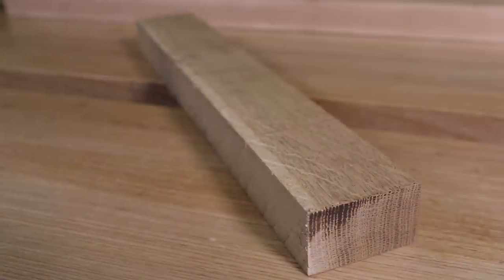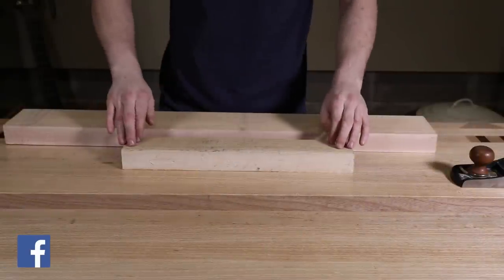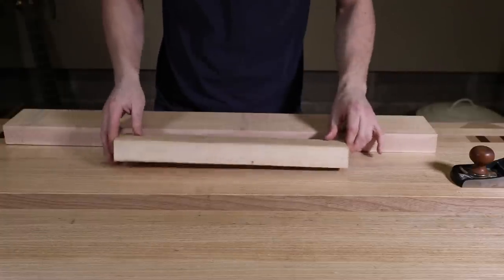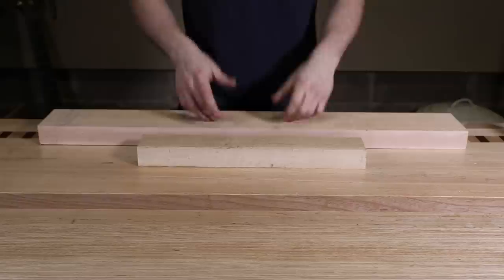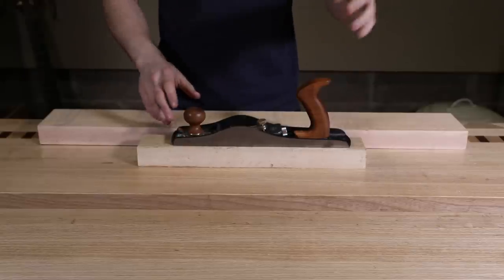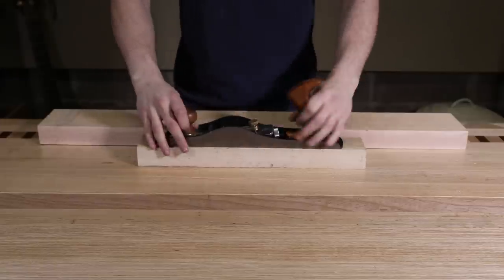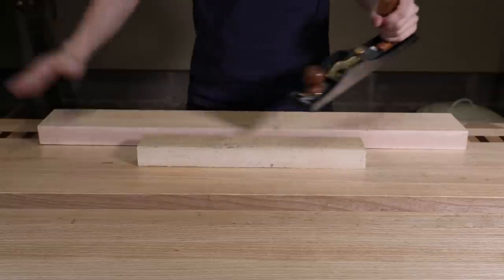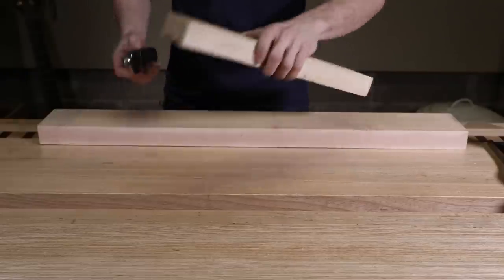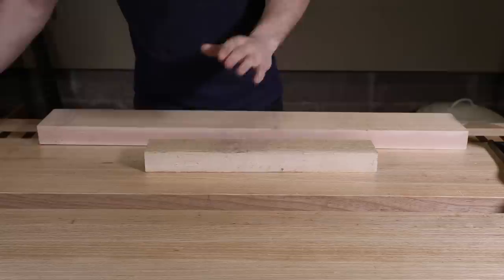The other thing about this oak is there's about a centimeter of sapwood along the edge — not a massive problem, but what I'll do is plane the top surface, have a look at it again, and if I don't like it I'll either saw it off by hand or attack it with a scrub plane. In terms of tools you need for this project: a plane is essential. I did a video on what planes you need — the link is up here. This is a jack plane or a low angle jack plane and it will work perfectly over something this length. A block plane is also handy, not massively essential, but nice for trimming end grain once we've glued it all together.